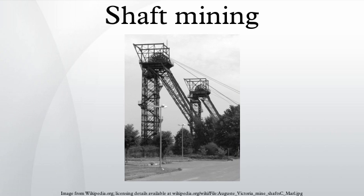Shaft compartments: where the shaft is to be used for hoisting, it is frequently split into multiple compartments by shaft sets, which may be made of either timber or steel. Vertical members in a shaft set are called guides; horizontal members are called buntons. For steel shaft guides, the main two options are hollow structural sections and top hat sections. Top hat sections offer a number of advantages over hollow structural sections, including simpler installation, improved corrosion resistance, and increased stiffness.